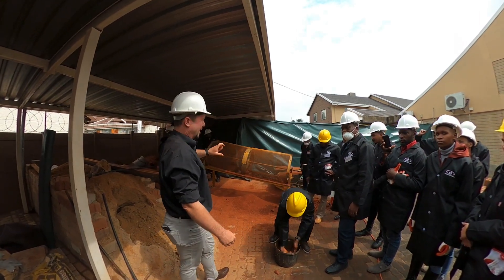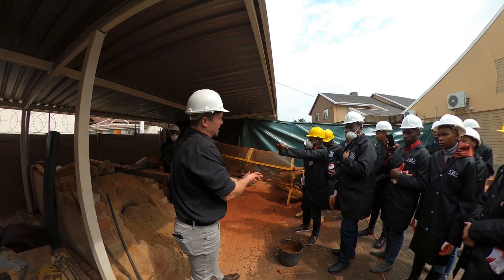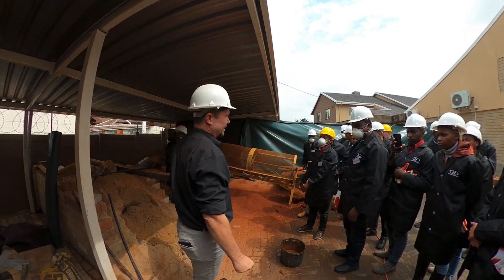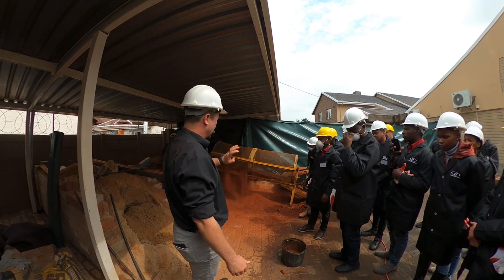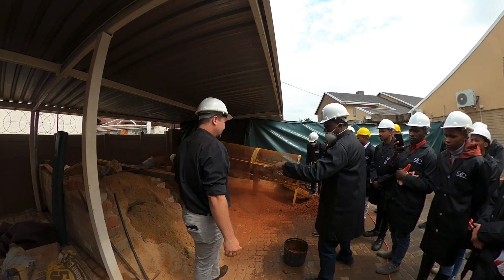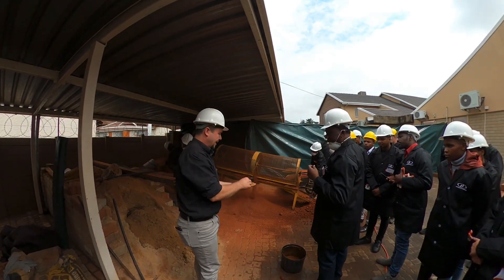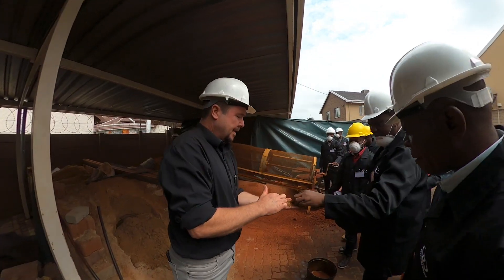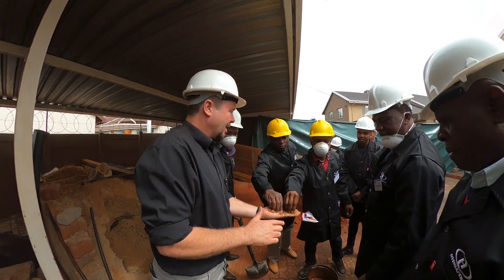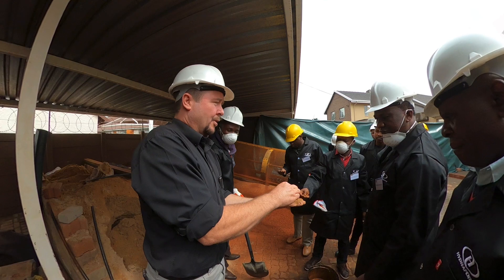Five buckets of sand in the water will fill up with soil to reduce the clay percentage. We will start with four buckets, see how that goes, and then we will start with other buckets. These are so good because they are coarse sand — you can see the stone that didn't sink in this. This is no clay, it's a washed sand, so it's like a river sand but it has that coarseness that you need.